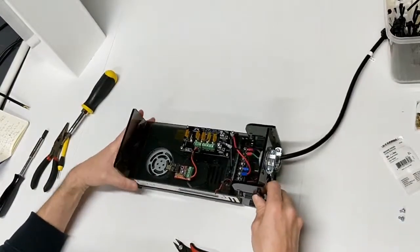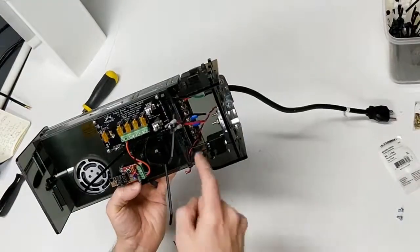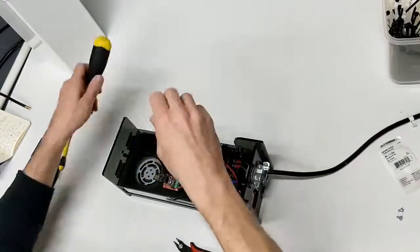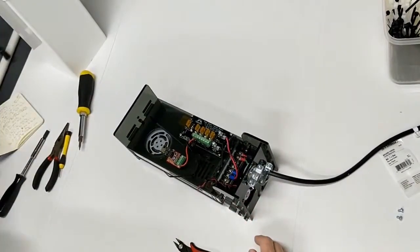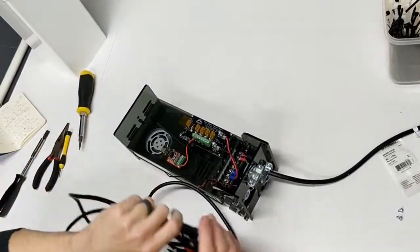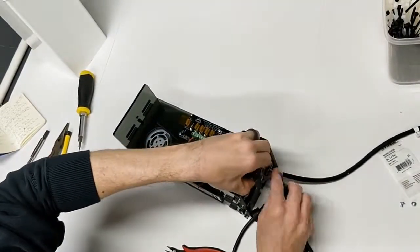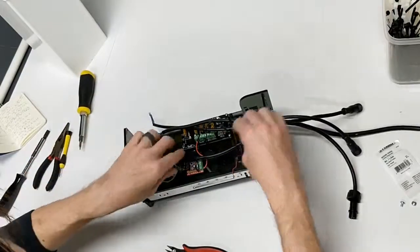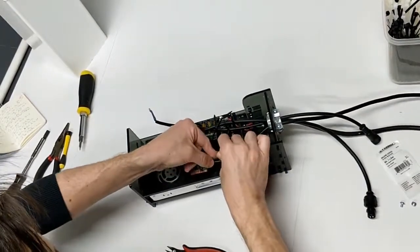Our case is coming together nicely. You'll notice that I put these wires on earlier — there's actually access to be able to get down to the power supply screws, but it sure is a heck of a lot easier to go ahead and do it before you assemble. We're going to go ahead and put our pigtails in — this one is the data, and these are some power injection pigtails. You'll see where these zip ties come together; for example, this pigtail is going to come right in here and this zip tie will hold it down.